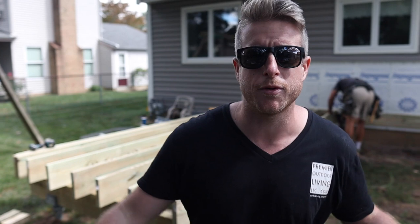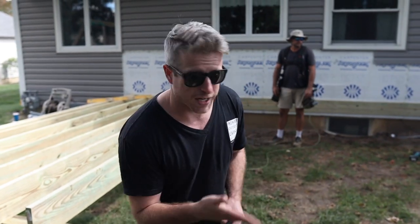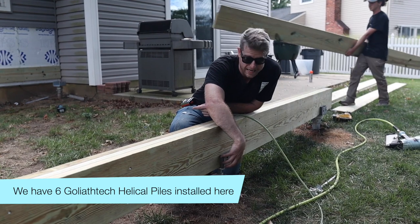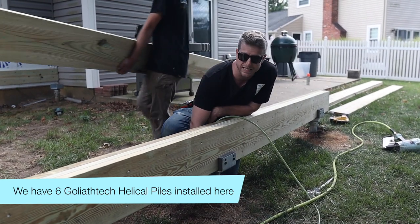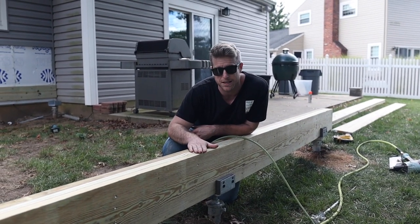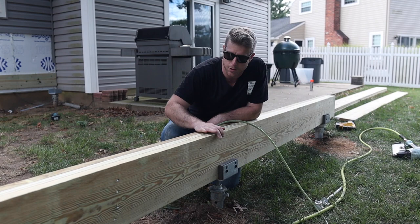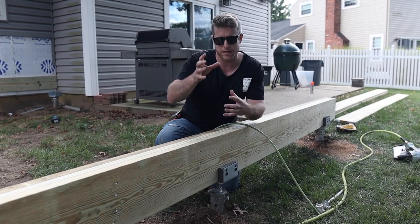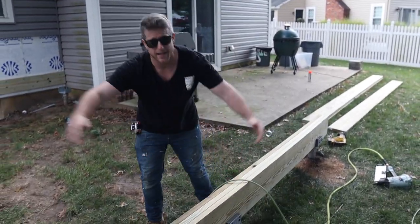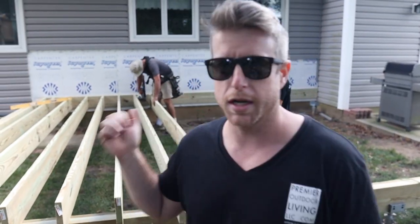It's our first full day here, but we're jumping right into the framing because we had our footings installed already, so we don't have to wait for that inspection — we can just get right into framing. The one thing I really love about these, especially on low decks, is this adjustable saddle. We can set these a tiny bit low, spin up that saddle so the beam can sit right on top of the footing. That makes it quicker — we don't have to mess around with 6x6s getting it to the right level, and it's a lot more sturdy. No bracing needed because we're not coming up off the footing at all. Now we just fly with these joists. Because we're doing 16 foot, we had to do 12 inches on center. The really fun thing is going to be the roof framing — we'll be getting to that soon.